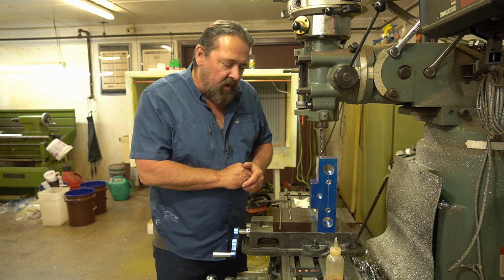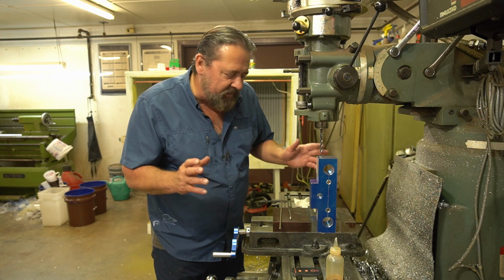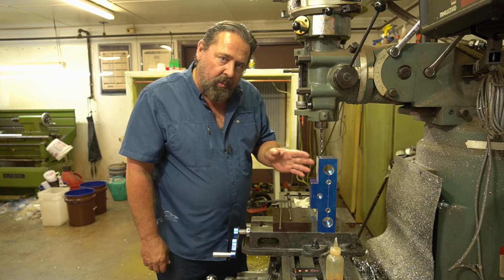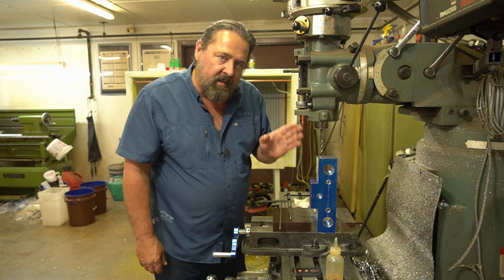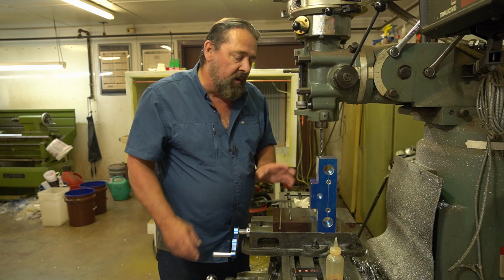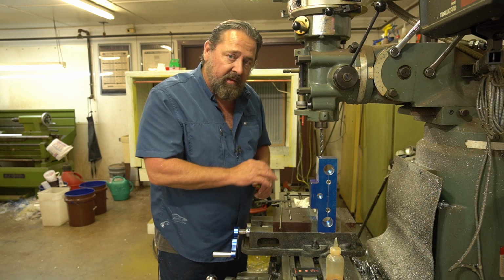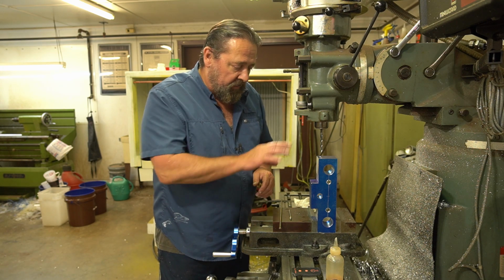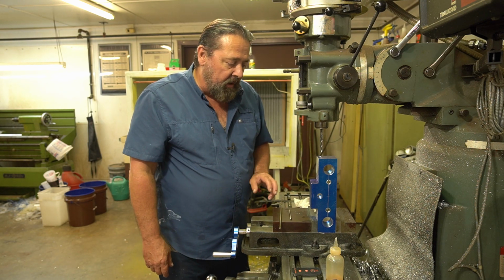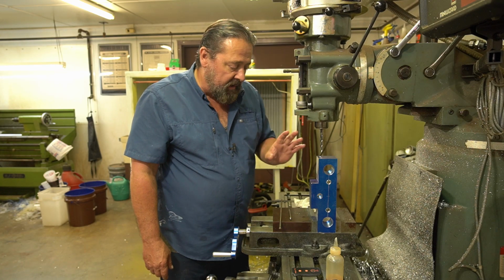This is really not the most difficult part of this process. It's just the most pain in the ass part, I guess. The rotary table and the profiling, that can be challenging. What I'm doing is basically getting my main tap hole drilled. As long as you get your main tap hole through here, you can come back with your clearance drill and also your countersink for the head of the screw, so you can countersink that down into your material. Then I'll just flip it over and do the other side after I get finished doing this side. After I get my pilot holes drilled, my tap holes, then I'll continue on to this piece down here and get that taken care of.